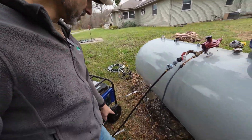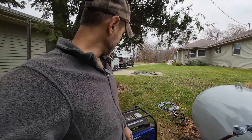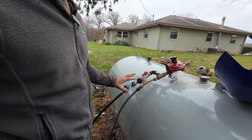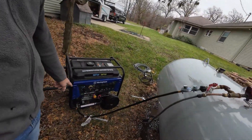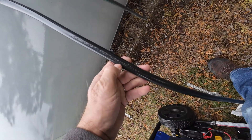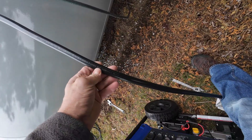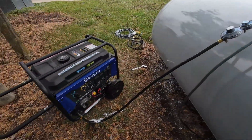I've already tried it — I hooked this short hose with the valve on it up to my 3/8 hose that's about a 40-foot long hose, and it will run just fine. So if you're battling this issue, it might just be that you need the right valve in between your main valve on your tank and your generator. I wish I knew more of the technical side of why it takes this particular hose. It says it's an LPG/NG hose — so I'm guessing that's propane and natural gas — 3/8 standard. That's all I can tell you: it took this particular configuration to make it work.